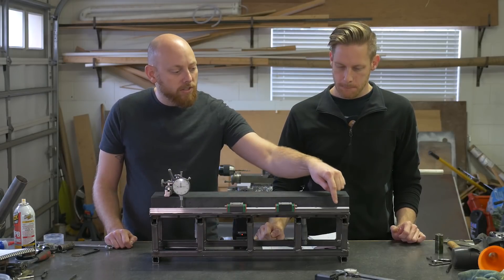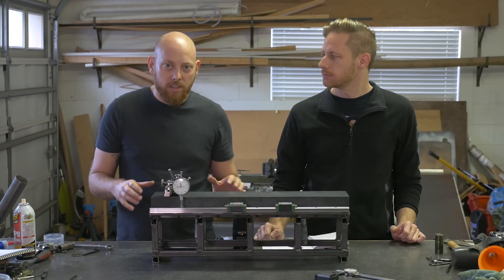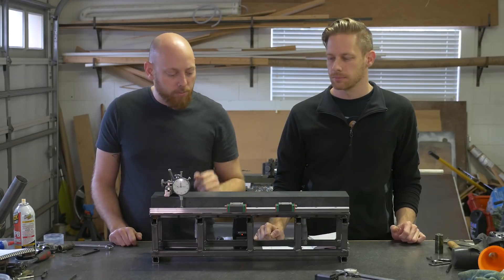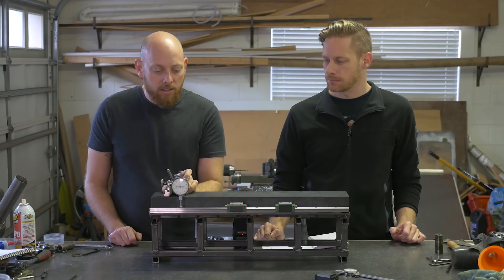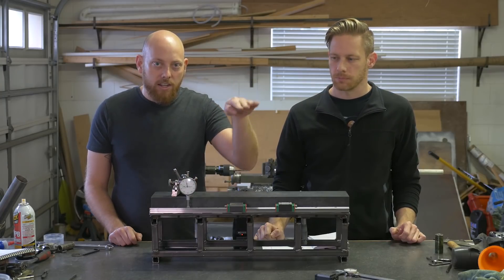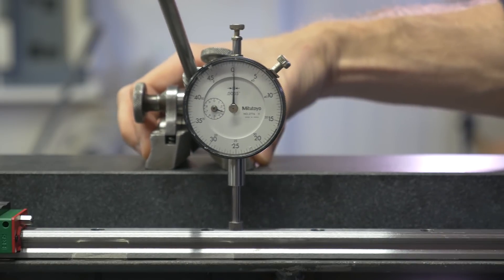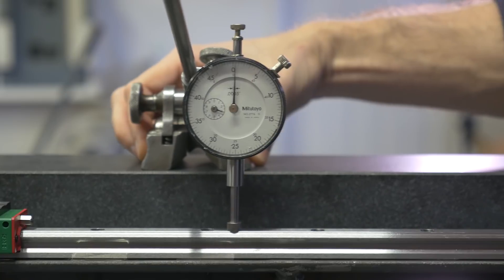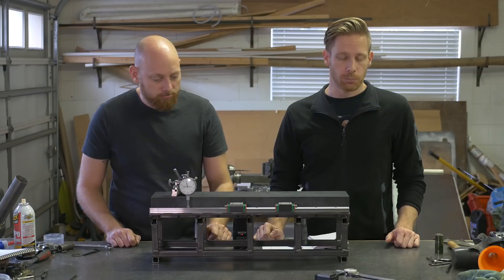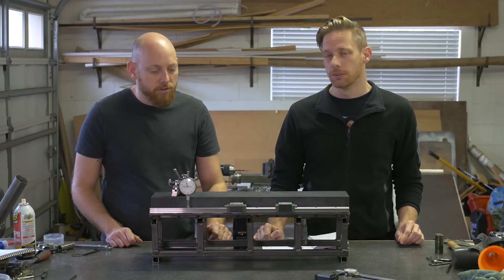One thing I did notice is that normally bedways for this sort of thing are cast and are one solid piece. These are bolted down — there are bolts pretty frequently — but you'll notice that the measurement here is not the same as it is here; they all kind of do a little bit of that. But again, that's probably within a quarter thou at the most, so it's within our tolerances. It's subtle, but the ends of these are a little bit higher because there's nothing really supporting them to pull them down. We could put bolts in that — maybe we will on the real thing.